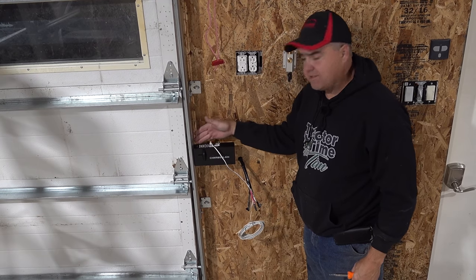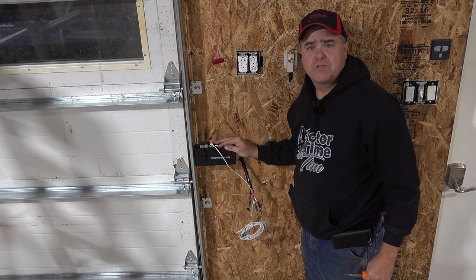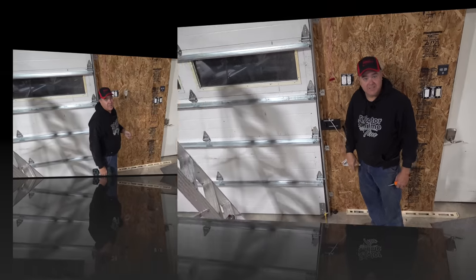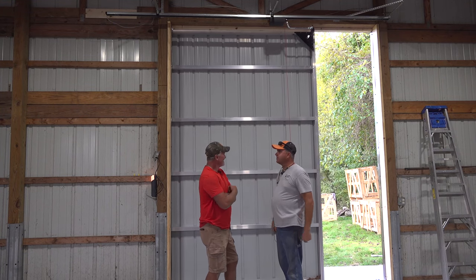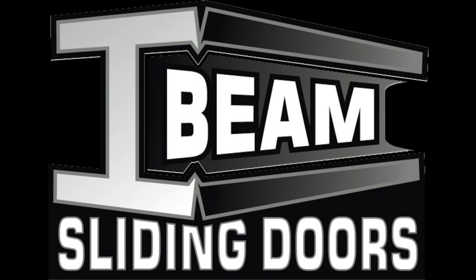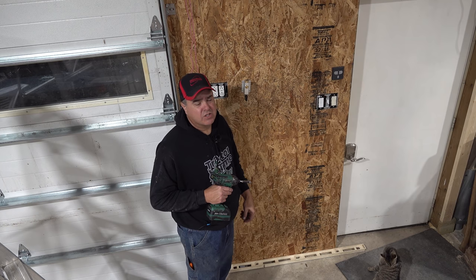The only problem with this is it seems like it's going to be kind of in the way — it sticks right out. One thing I liked about this door was that it was all way up there out of my way, and now I've got this piece right in my way. It suggested going all the way down to the second roller — and you can't see it from there, but it works beautifully. I originally thought I'd put the door controller over by the power sliding door — that's a power slider meant for horizontal sliding doors up to 24 feet wide — but I'm going to install the controller closer to the door to avoid running wire all the way across.